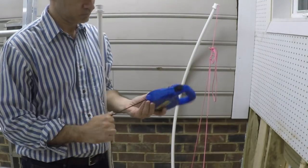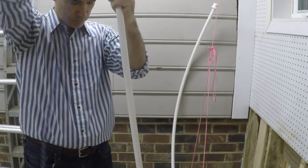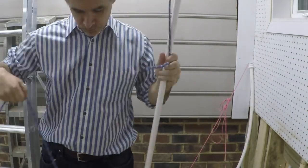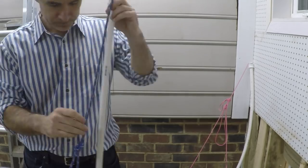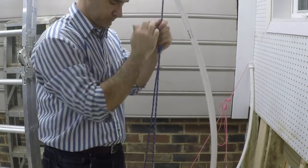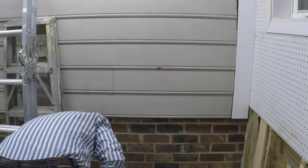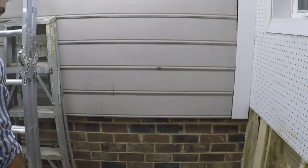There are several ways to bend PVC. I find that using boiling water is the fastest and easiest. Relocate to some place where spilled water isn't a problem. Place the reducer bushings on the end of the half-inch pipe. This is important, as otherwise the ends may deform enough to make it difficult to fit the bushings later.